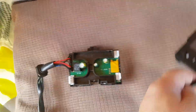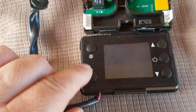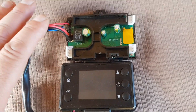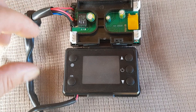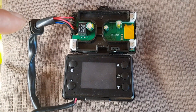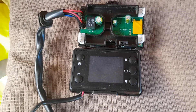There's also the very, very good controller that the chap in Australia makes, which I think is called the Commander, and that has lots and lots of functions. If you've got this controller working you can use that. But that Commander will not work with this board - big giveaway is this capacitor on here. If you have this board you will have this slightly different controller, and apparently they use a different protocol, so this will not work with the blue controller with the little red fob with the LCD on it, and it won't work with the Commander. I'd like to get one myself but apparently it's not delivering to the UK at the moment - hopefully that'll change soon.